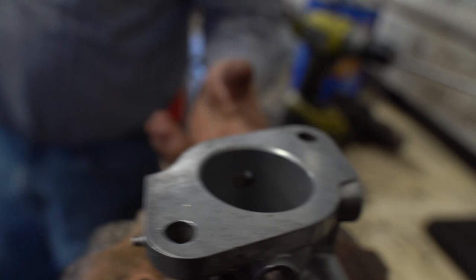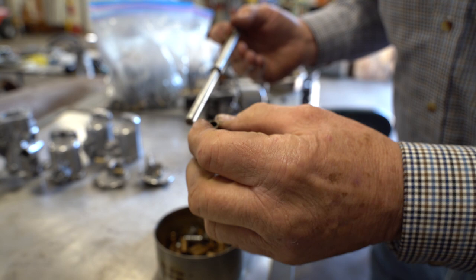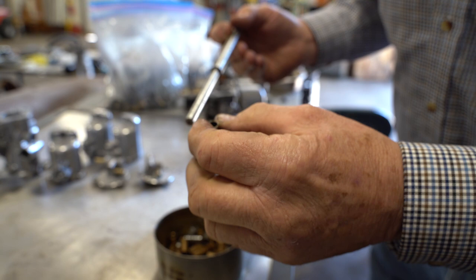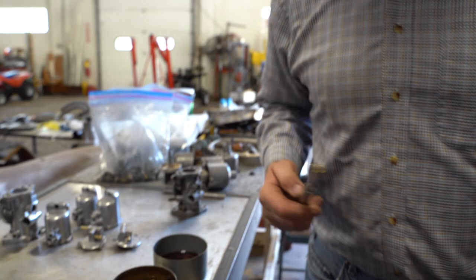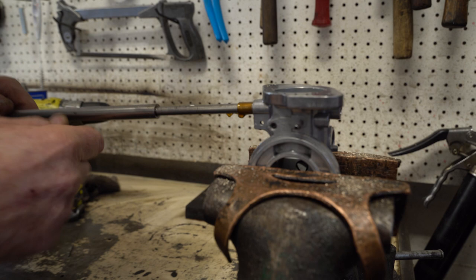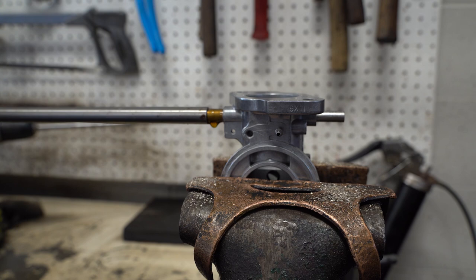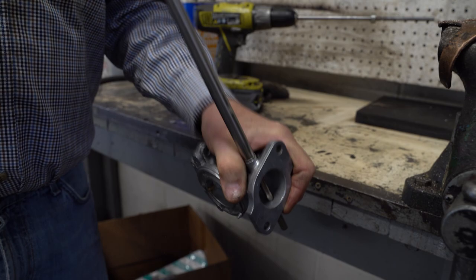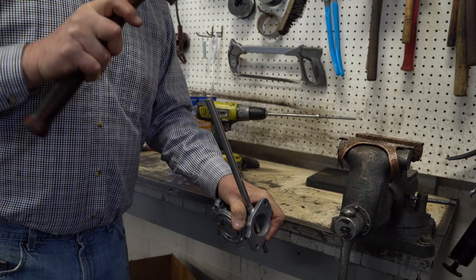Now I'm going to take my bushings. When you buy the bushings in the kit they're steel, but I use oilite bushings — impregnated bushings — and they've been sitting in oil for I don't know, four, eight years, so they're thoroughly soaked. I've got one short one that I'm going to put in on the side where the adjuster screw goes. I'm going to do this by hand. He's home and standing just a little bit proud — I'm going to have to grind him down.